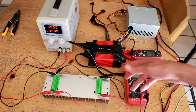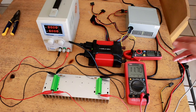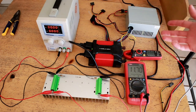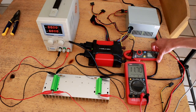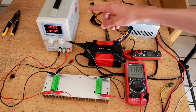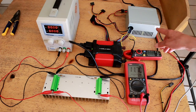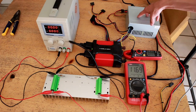I have two loads connected to the inverter: a 100 watt light bulb as a base load, currently switched off, and a DC power supply connected to a bank of power resistors. When I turn on the light bulb I'll automatically load it up to just over 100 watts base load, then I'll be able to linearly increase the voltage across the resistors to directly influence the amount of power delivered from the system. This power supply is rated nominally to 17 amps at 12 volts, which we're going to test.